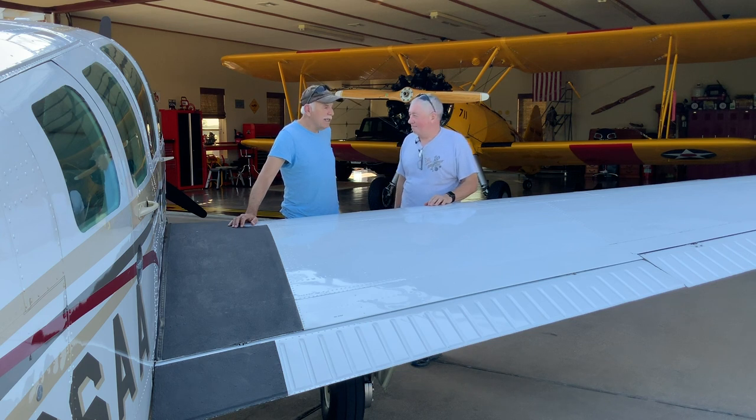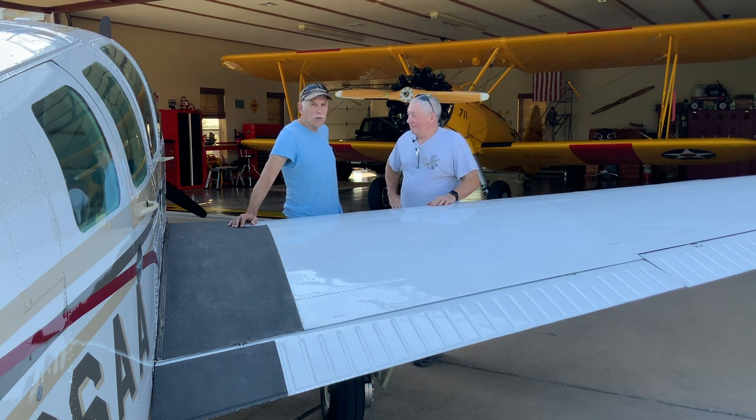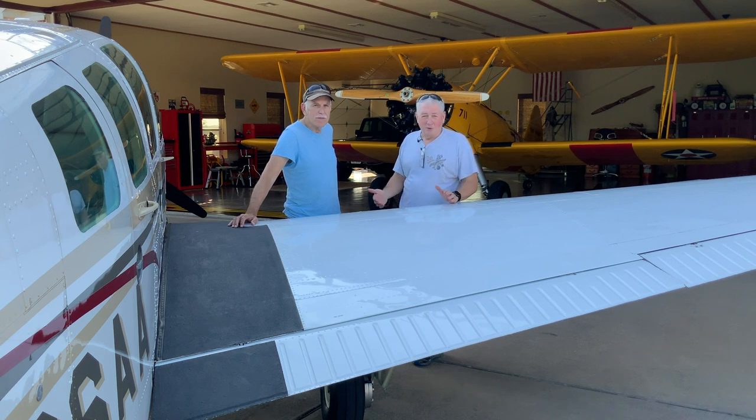So that's one thing. Now you'll see that in the video where we discovered that as the airplane was drifting off and doing what it wanted to do until we went to the system and armed it. We learned some stuff about the autopilot and usage, and played a little bit with flight plan, and then approaches, fixes. We saw how the airplane reacts in the flight plan for the next waypoint, how to add waypoints and then steer to them, and how the airplane reacts with the GPSS steering to that point. It's all wind corrected, and that's pretty cool.